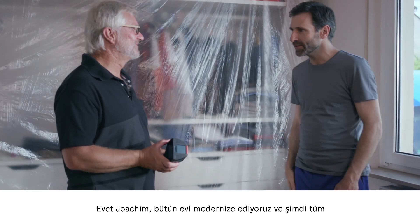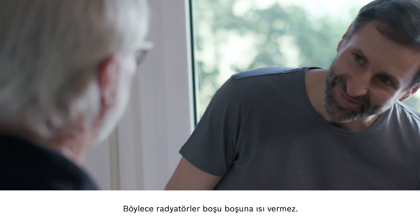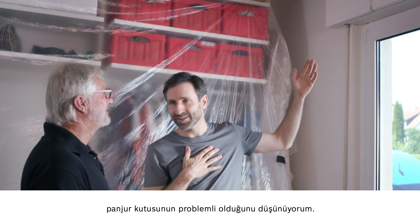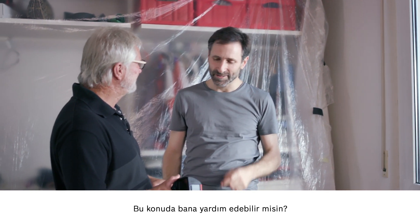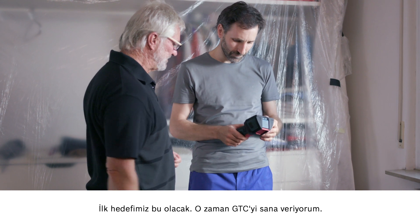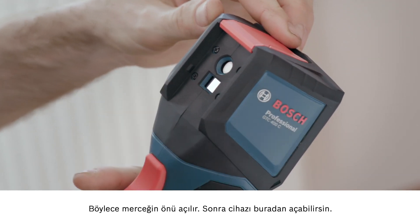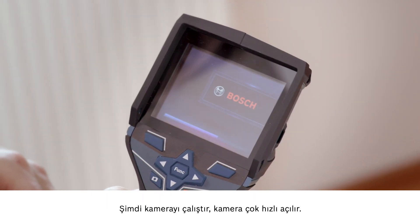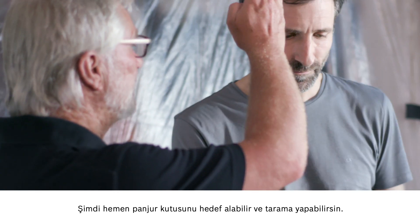We're looking to modernize the whole house, so I need to check every room for thermal bridges — to make sure that the radiators aren't emitting heat for nothing. And in this room in particular, I reckon that the old roller shutter box is going to be a problem area. It certainly looks that way. However, I'd need some proof of this to show my customer. I'll pass the GTC over to you. First, you need to open up the protective guard on the front — this flap needs to go up. Then the lens is exposed and then you turn the device on. The camera will start up now and it doesn't take very long at all. Then you're ready to point the camera at your roller shutter box and start scanning.